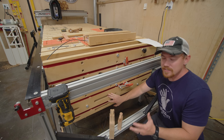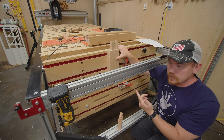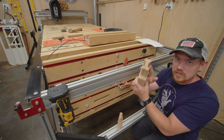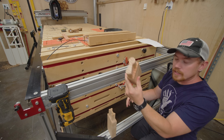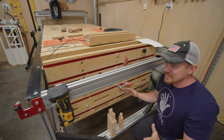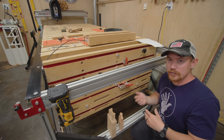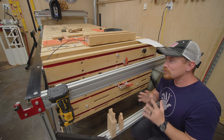The front of the machine is the most exciting to me because I put a vertical table on here so you can mount stuff vertically and make joinery on the ends of your material — it's almost a limitless joinery machine. There's a dog bone tenon and a keyhole tenon — these are just little test pieces I kept. A vertical table is something I highly recommend on any CNC machine. If you have a CNC machine and you don't have a vertical table, try to pursue putting one on there and figure out how it works with your machine.